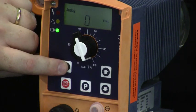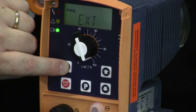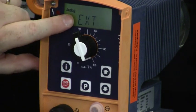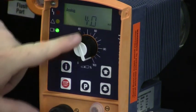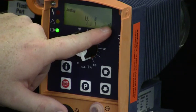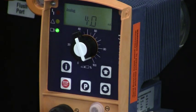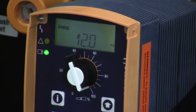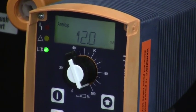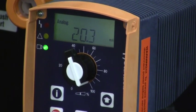I can display that information using the I key to show different data. Now it says EXTERNAL, which means the pump will operate from an external signal. I can also display the current signal coming into the pump — here I have 4 milliamps, shown on the right-hand side of the display. As I change that up to 12 milliamps, the pump runs at 90 strokes per minute, and at 20 milliamps, the display changes corresponding to the signal coming through.